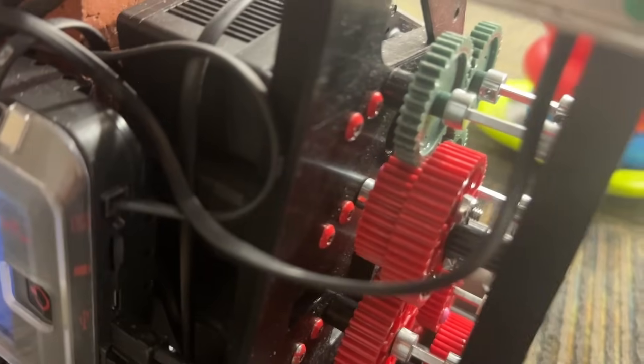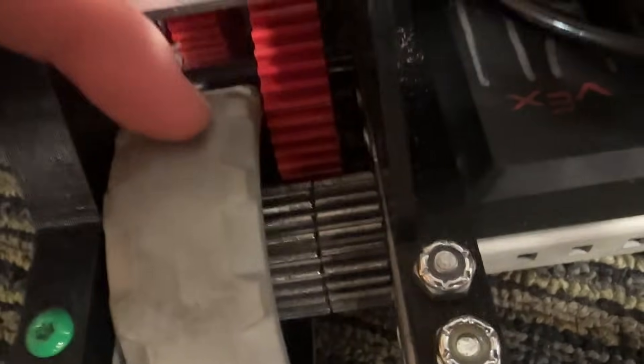The drive base has 36-tooth gears on the top three motors. The second tallest motor at the back has a 36-tooth gear and a 48-tooth gear. These are all spinning at 200 RPM, and that 48-to-48 is still 200 RPM — we just changed up the spacing to get it more compact at the top. From that 48-tooth gear, that meshes with a 60-tooth gear, and that 60-tooth gear is our slider gear because we have a speed transmission on this robot. Getting a gear ratio that was not too fast in speed mode and not too slow in torque mode was definitely a challenge. In speed mode, the 48-tooth meshes with the 60-tooth gear, then the 60-tooth meshes with a 36-tooth gear. That meshes to a 60-tooth idler gear, and then 24-tooth gears on the drive base, giving a final speed of 400 RPM.